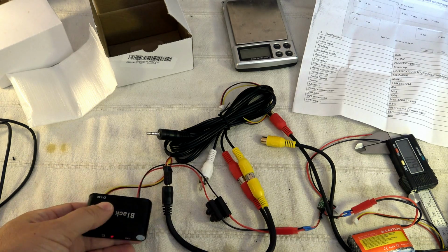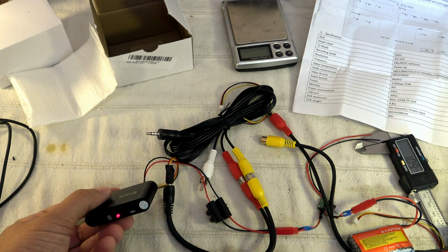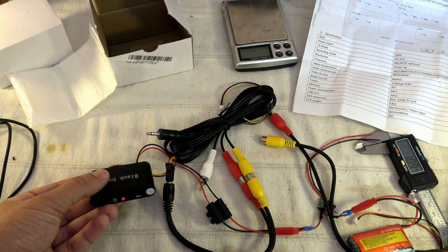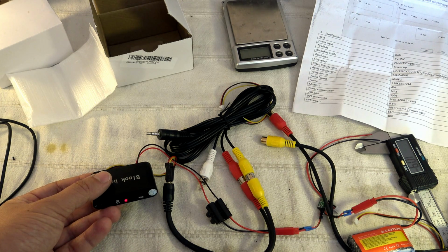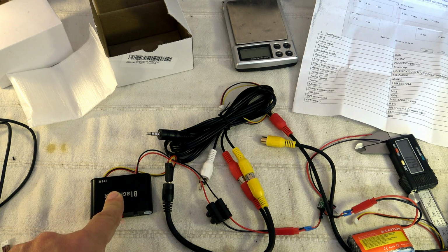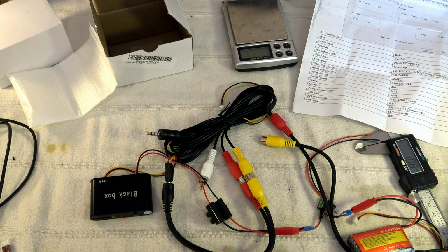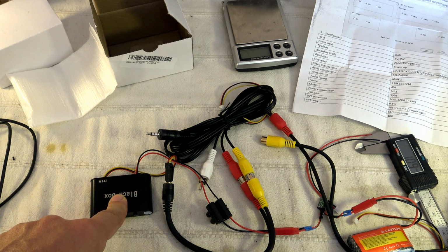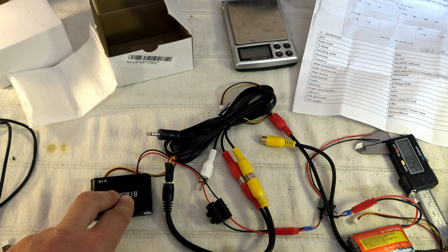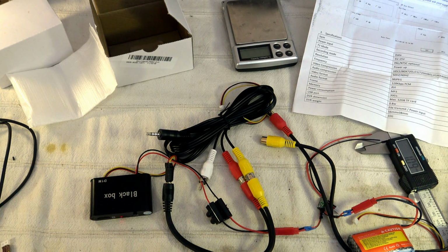So now it's time to check, as I said previously, what the cropping effect will be. I will start with some NTSC source, put some elements in the 4 corners, and we'll see first if there is some cropping only from the DVR. We must check that our receiver, the 5.8 GHz, also doesn't introduce some extra cropping, so to be sure. And maybe, if it's not the case, we'll be able to see if this one is introducing some cropping.